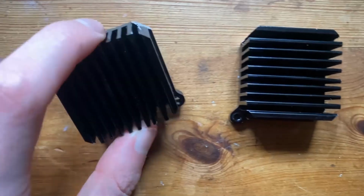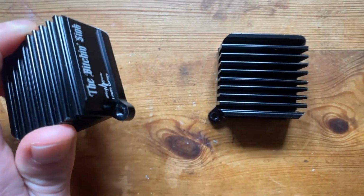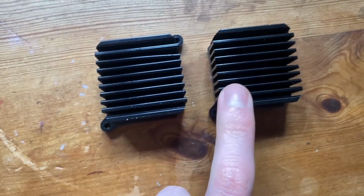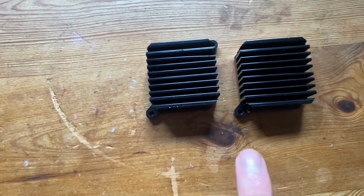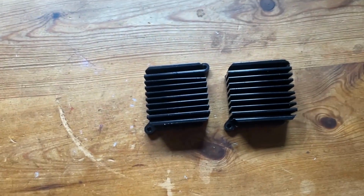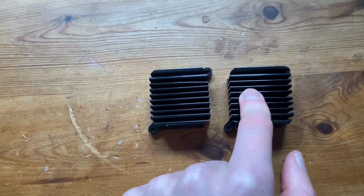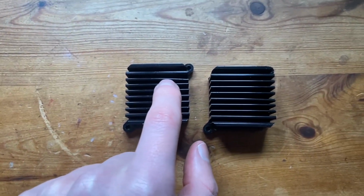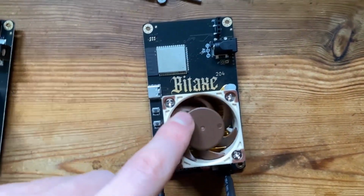So let's take them off the rig, and then let's get into replacing the thermal paste and putting them back on. Basically going to be the same thing that we were doing yesterday, but with these two heat sinks now, with the two going across. As I said, we have made recordings of what we have in terms of the temperatures, and we're going to keep the overclocks exactly the same to see if it brings down the temperatures. So let's get them off the rig, and let's take off the older fans as well. So here we have it, we have both of them taken off now, and let's just take off the fans.